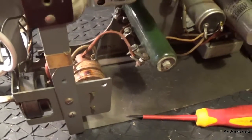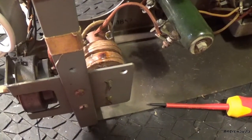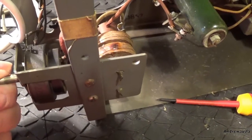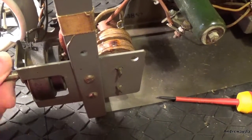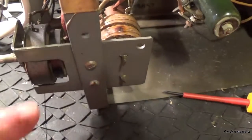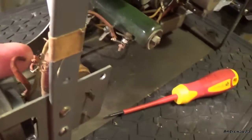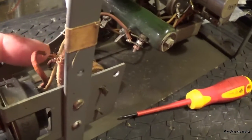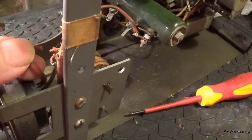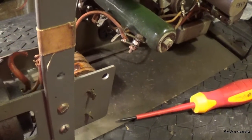So another little entry. What I'm doing here is removing the tone control on/off switch because it doesn't work properly. It clicks off but it doesn't click on - so many times it clicks off, it doesn't click on. These are either gummed up with grease or the little ratchety thing inside is worn. That's coming out. I've snipped halfway - this wire goes off to the choke here and there's another wire that goes off. I've clipped those roughly in the middle because I'll be replacing these wires anyway, as they're hard and brittle, and that's got quite high voltage on it, so I want that to be modern wire.